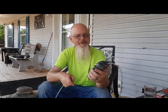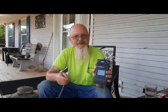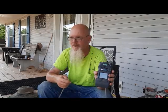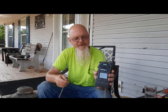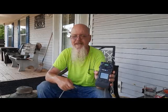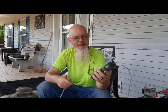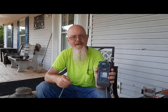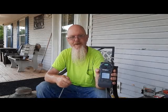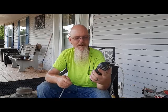That test passed, so we have to use these every time we get into a confined space or a manhole. This does a test for oxygen level, which OSHA 1910.134 will tell you that you have to have a minimum of 19.5% oxygen to be safe in the environment that you're working.